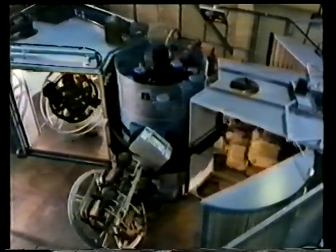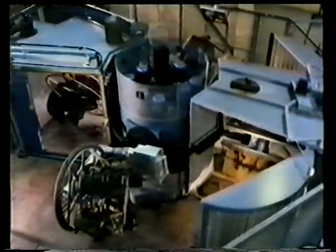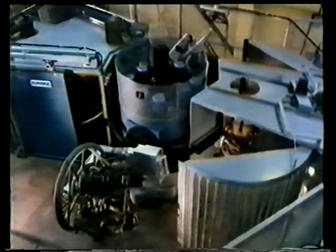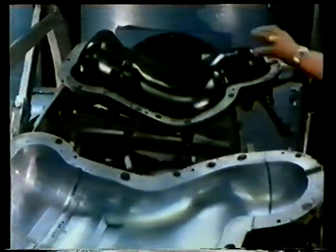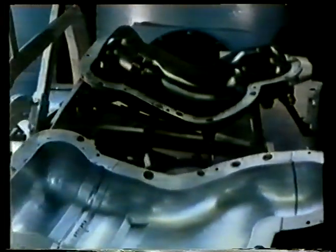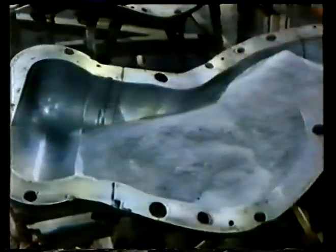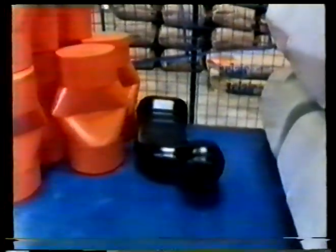After the mold leaves the oven, it enters a cooling chamber where either air or water is used to cool the mold and the polymer inside. Rotational casting is ideal for hollow objects. Usually, the best results are achieved with simple shapes which have a fairly uniform cross-section. It's a relatively simple and cheap method of production, and its adaptability is making it increasingly attractive.